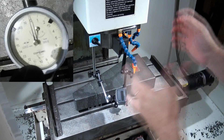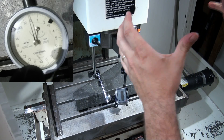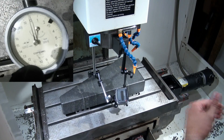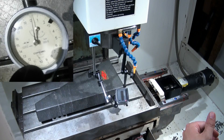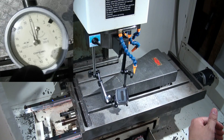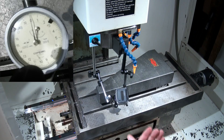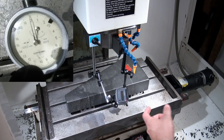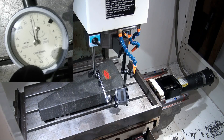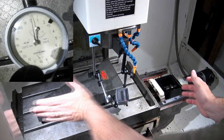We're back at the machine. I'm recording a lot of these videos at the same time while I have everything out and apart during my yearly maintenance. The square is already set up from our straightness test. We'll run back and forth one more time in x just to make sure that the long side of the square is sitting perfectly straight and running parallel with the motion of x. Our x is running very straight and very true. This dial indicator has each number equal to 4 ten-thousandths of an inch, and each minor hash mark is 75 millionths. We are very, very straight, with just a little tiny bit of tail off at the very end.